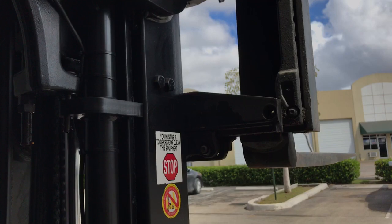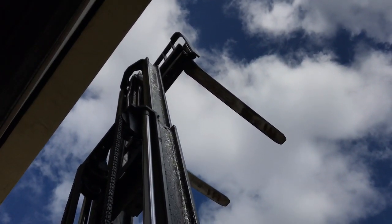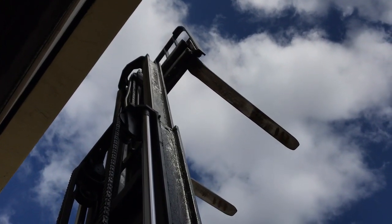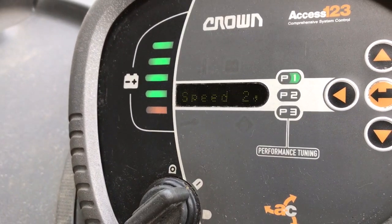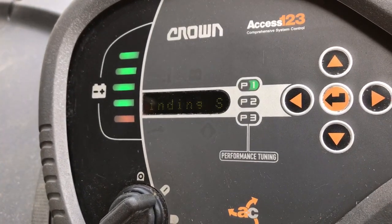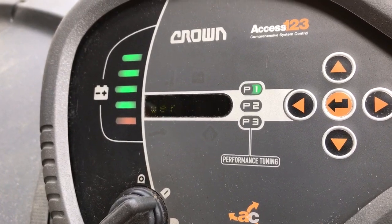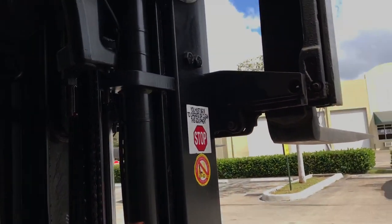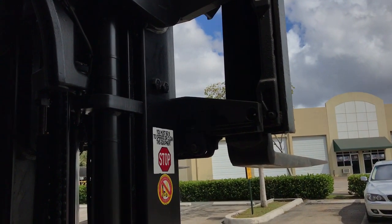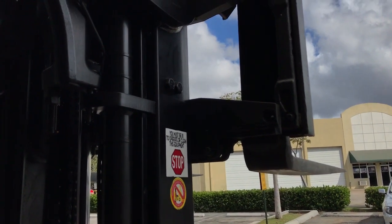Stop command. Now raise again. Empty and lower — climbing speed two, coming down a little faster. Now if you see it does not stop at this level where it's telling us to stop and just continues to drop, there's a problem. It's going to fail and you'll have to have a technician take a look at your hydraulics, make some adjustments or replace a valve. That's typically what might be happening.